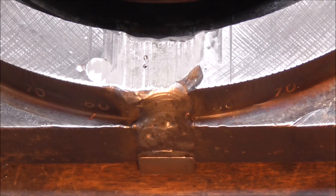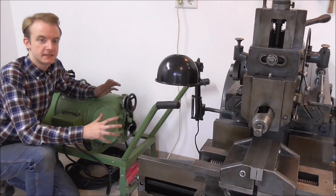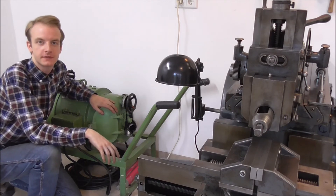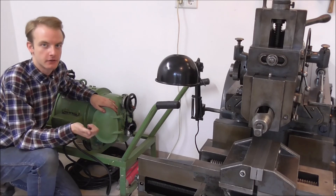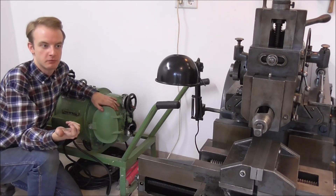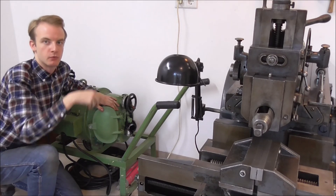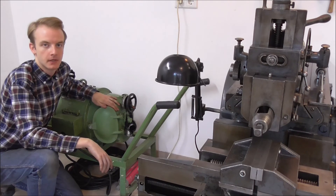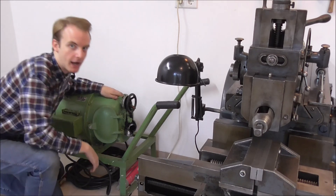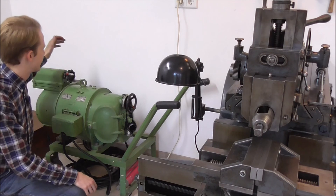Put it all back on the shaper, put the top on, hope it doesn't crack. The vise is fixed for now at least, and time is going to tell whether the weld is going to hold up or not. I am reasonably confident because I took every measure I could to prevent stress build-up. I mounted it so that the weld is facing forward, which means the cutting force is actually pressing it down instead of levering up on it. I think it's nonetheless a proven test for the welding. I hope I'm going to have a couple of projects to use this on in the future. And even if I don't, this thing is kick ass — I love it.